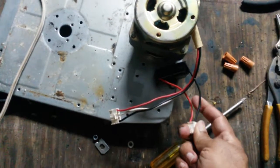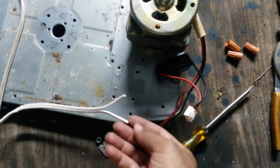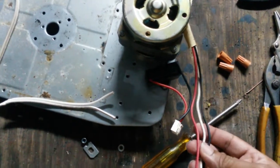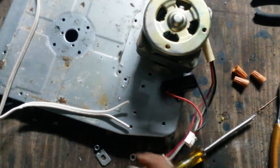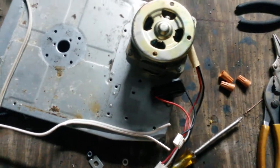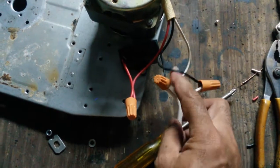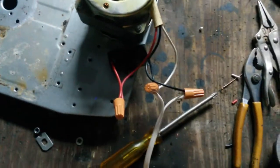For the final strip-down, what I'm going to try is connect up this motor and see if it works. I've got the end of the plug which I cut out earlier. I assume this is the start/run capacitor — these capacitors are always in. Three wires: my assumption is red goes to red, this black goes to white, and this other black goes live. The other connection is black and white. Hopefully I have this correct — we'll find out shortly if it goes poof.